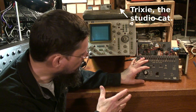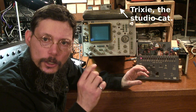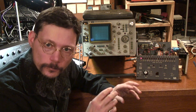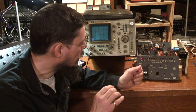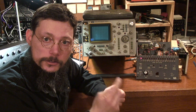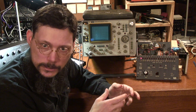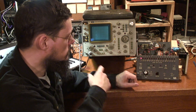I've had a few repair sessions with the Model 800 and basically have things working again. I replaced the low-voltage capacitors in the power supply circuit on the main board. I replaced about half a dozen flaky or dead logic chips. I fixed the clock circuit. I replaced the comparator on the gate input so it can actually record sequences. I also cleaned up a ton of messy wiring, flaky wiring, and bad solder joints, so things are much more stable. I can actually record a sequence now.